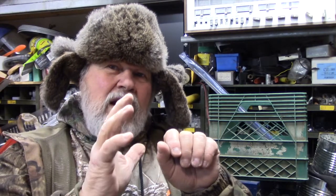but it's not the end of the world, because if the screws are not as tight as they can be, like tight to almost squeeze the juice out of the wire. They gotta be tight. A good connection. Okay, see here it already sparked. Well, if I was to tighten that and not clean it, there's carbon buildup in between the screw and the wire. Well, that'll never be a good connection. You gotta sand that down, make your connection, bring it in tight. Then you're sure, but it's still, every joint is resistant. It's a resistive point in your wire, okay?